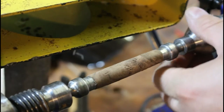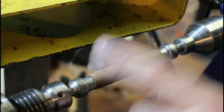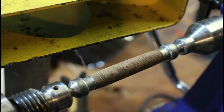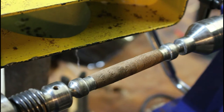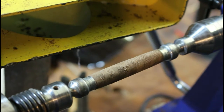The blank has been turned - this is Turkish figured walnut and the pen kit we're using is the new headwind from Beaufort Inc. It's been turned but it's not been sanded at all yet, so it's not been prepped. We're going to set the lathe speed to a thousand. You don't want any more than that because if you go higher you'll end up burning your sandpaper and you'll just burnish the wood - you're not sanding it.